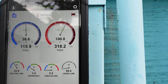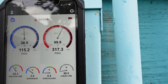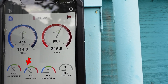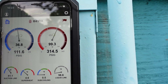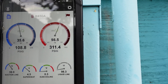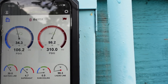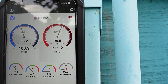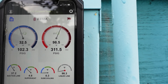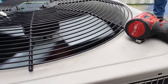We've been running for about two minutes now, and we're still running pretty safe pressures. No blower fan. Superheat's kind of low, but it's not nothing. Finally getting to the freezing point. Shutting it down. That's pretty conclusive for me. This machine's going to have to get a new compressor.